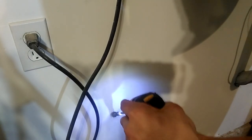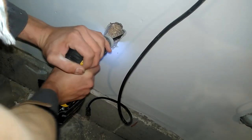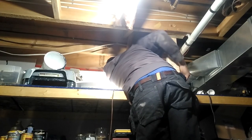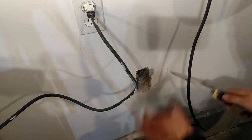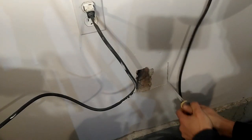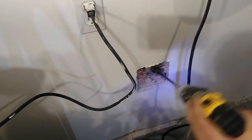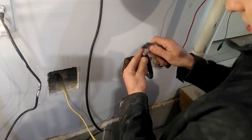The first thing I did was go outside and start drilling a hole through the drywall. I ended up needing a longer bit extension to get all the way through that 2x6 wall plus the rim joist at the right angle. I tried to feed both cables through at the same time, but they didn't fit through my 1-inch hole, so I drilled it a little bigger. I moved my box hole over to the next stud cavity to the right, drilled another hole, and then that line fit.